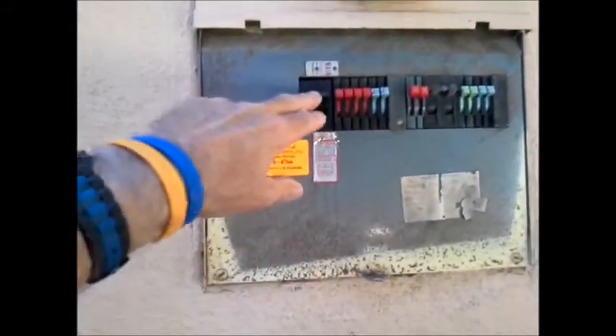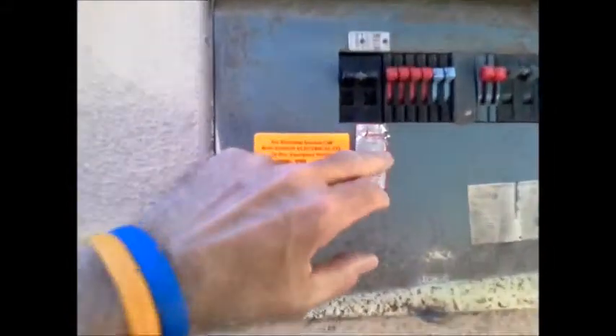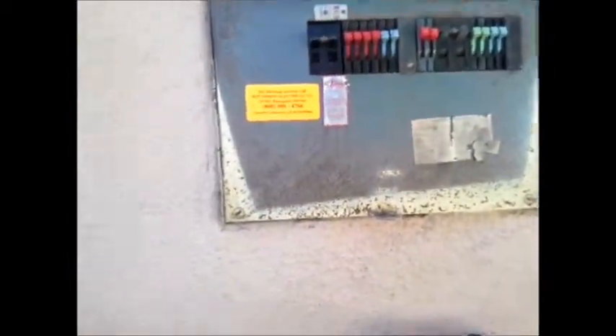There's a main panel at the very rear of the house and the hinges are broken. It's a 100 amp disconnect and it's a Zinsco type of panel. It's a very popular panel and now 30 or 40 years later it's come back to haunt us — they have problems with corrosion and spring tension and things like that. Today the electricians out here are repairing some electrical problems with the house, though I haven't heard exactly what they are yet. That's how to shut the electricity off.